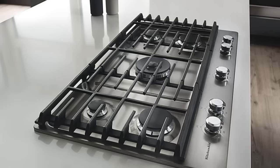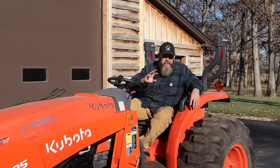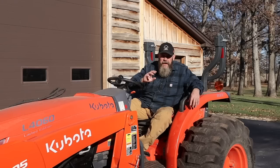So what we do get from our boiler is a lower gas bill — not a zero gas bill because our dryer and stove still run off the propane. But we also get the freedom to heat as much as we want. There is no guilt heating your house to 80 degrees. And since ours does the hot water — 152-degree water, which pretty much melts your skin off — but with an on-demand boiler you will never run out, and with that coupled to the outdoor wood boiler, it's pretty awesome.